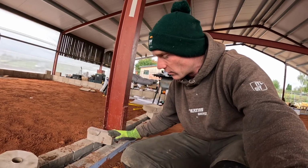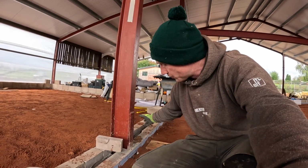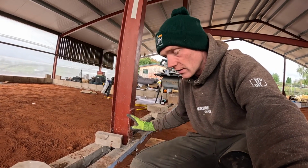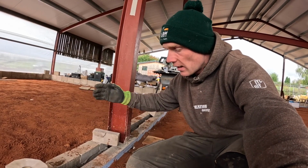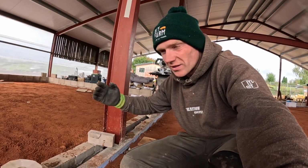So what we'll end up having to do is, because the doors will take longer than the slab, we will end up shuttering, and I'm probably going to do it with some steel angles so it's really nice and straight, shutter the concrete up to the finished floor height, and then we can take that away afterwards and fit our doors from the other side. I just want to avoid having lots of little bits of naff trim.